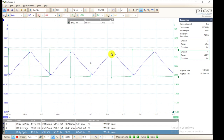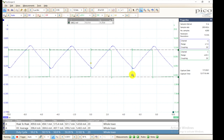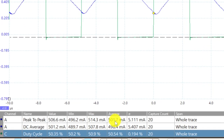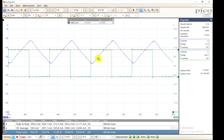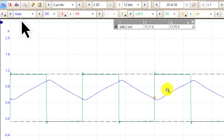Now watch as I bring the current up a little bit - you'll see that wave shape doesn't change, it just rises up from zero. Going up to 0.5 amps: the scope reads about 0.5 amps, agreeing with my load. Zero is there and the waveform floats above it - about 0.2 to 0.4 amps range visible. That wave shape did not change with the current. Now I'll go up to 1 amp - it just doesn't change. The scope auto-rescales, but the waveform shape is the same.